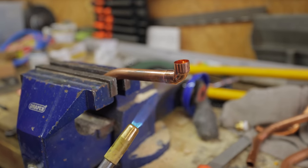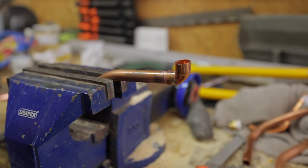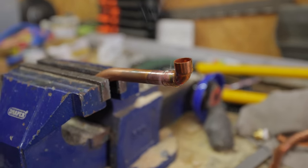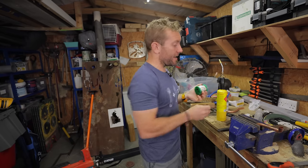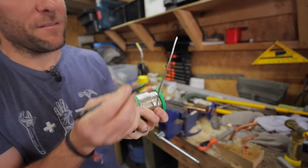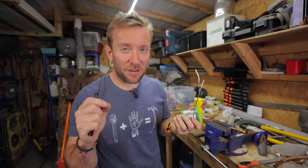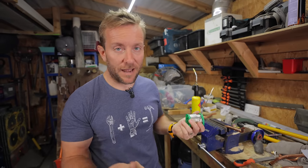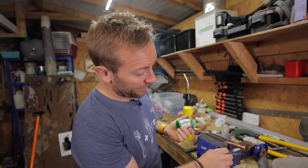I whip round and come round here, give that a little bit, and then get the solder and just go like that. That's not enough solder. If you're going to do a 15 mil fitting and you're just starting out, it might be a good idea to run your solder out and, if you want, get yourself a pen and mark every five mil on your solder. That for now would be roughly what I'd put into a 15 mil fitting. As a newbie, when you get more experienced you'll probably use a little bit less, because you don't want loads coming out. The other mistake people make is they whack loads of solder in and you end up with what we call pigeon poo on the bottom — it just looks horrible.